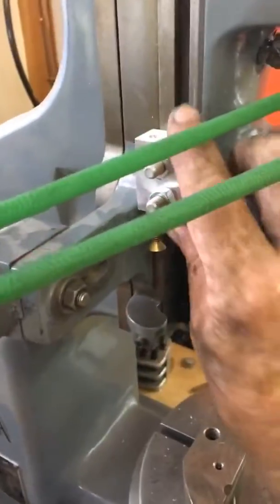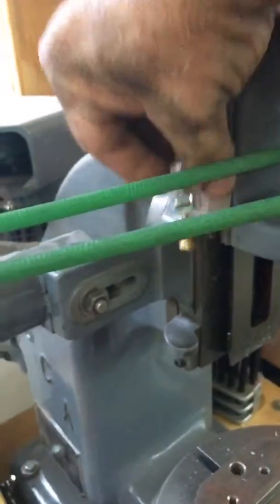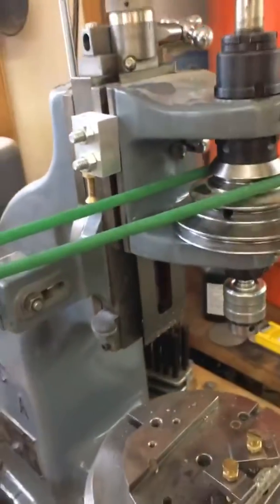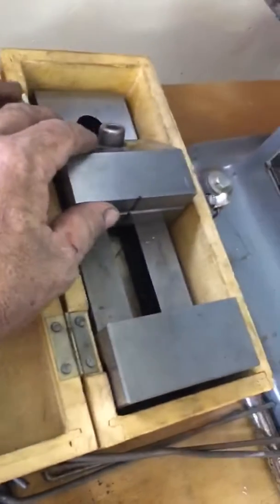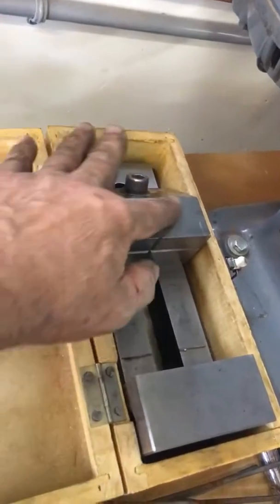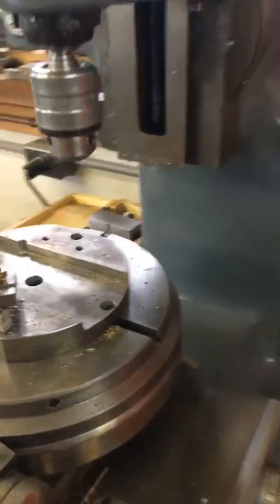Getting a few things together on the BRS. It didn't have a depth stop, so I made this little outfit that's going to be very handy. Another thing is having a precision vice on this — a precision grinder's vice from auction. This thing is wicked, very nice, high precision. It didn't have a drill chuck, so I made a sleeve to run it.